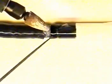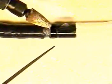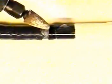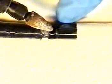Cut into the bending rubber partially to remove some of the old bending rubber, which will allow us to gain access to the other half of the glue joint. Again, using our Dremel tool or file, we will remove a small thin layer of glue from the endoscope without cutting deeply into the insertion tube right above the Scotch tape line.